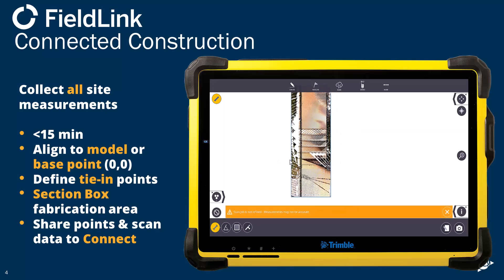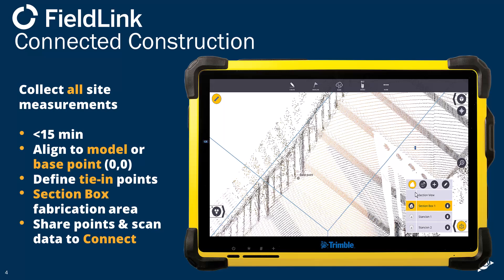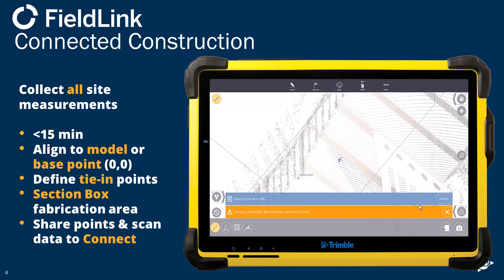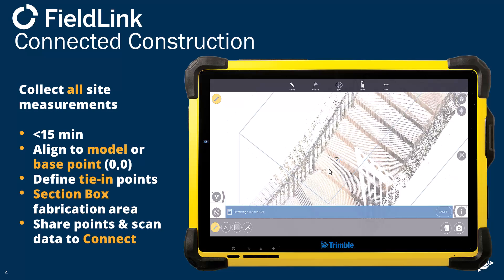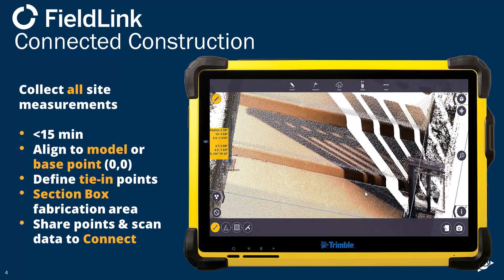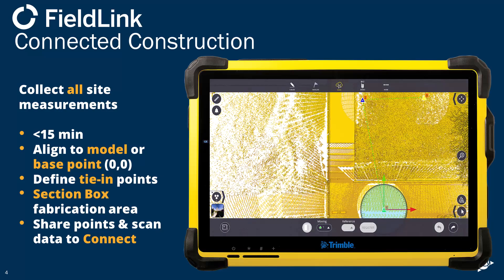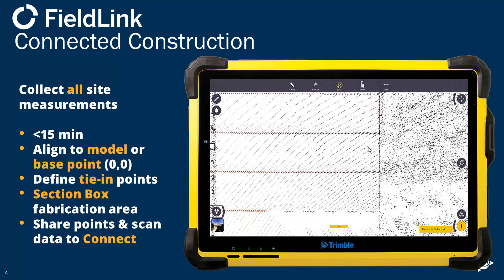The other tools that will make my life easier in Tekla is to start taking some basic field measurements. I can actually extract out the full data set in FieldLink very easily — this is all done on the tablet. I'm going to extract the full data to take some base measurements, like if I wanted to match this stanchion here — how far is this stanchion from the back of that stanchion from that wall, about two and five eighths or two and a half inches. So I'd want to match that one over here. I'm going to use the measurement tool as well as the ability to start creating points from the scan data by just selecting it.